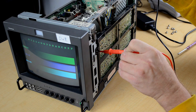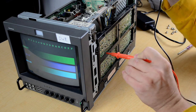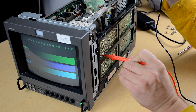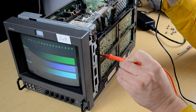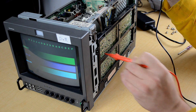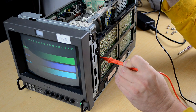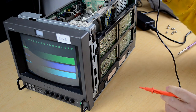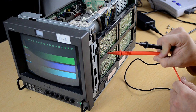There's not actually a ground pin — this is live electricity so we want to be very careful. I'm going to probe with my positive on the red and use the actual frame as my ground for my negative probe. I'm getting about 72.5 volts on the red. Moving to green — about 74 volts. The bottom pin is blue — 77 volts. So what that means is the color is being generated all the way up to this point.